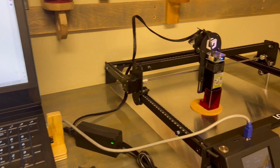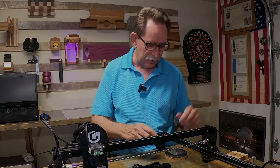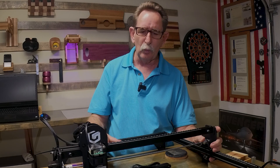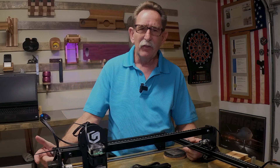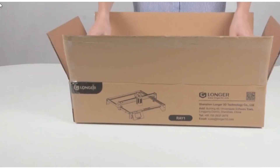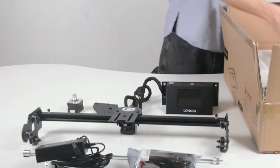This one has what I'll call an exposed belt rail system. It was very easy to put together with only one little glitch. Inside this corner there is a little grommet screw that turns sideways in the channel. I needed a pair of needle nose pliers to get that to spin in there and properly tension the belt. It really wasn't that hard, but I could see where it would be frustrating if you weren't warned. The whole top gantry system comes pre-assembled. You assemble the three rails in the front, slide this on, attach the back rails and feet, and you're done. There's a video showing the assembly process that comes with the instructions — it's an 11-minute long video. That guy has put one of these together before, so maybe it'll take you 20 to 25 minutes at a realistic pace. Not really bad.